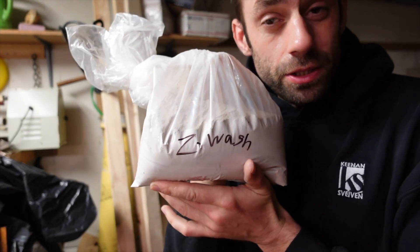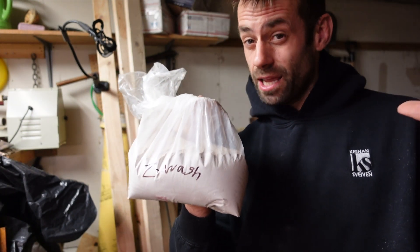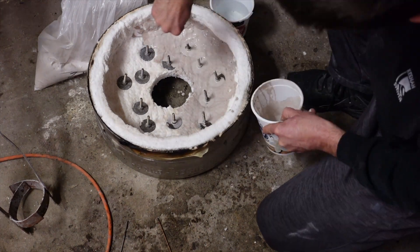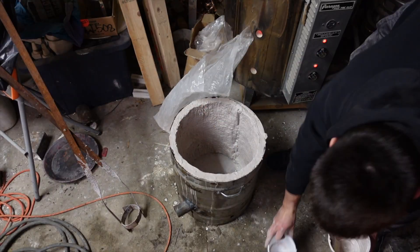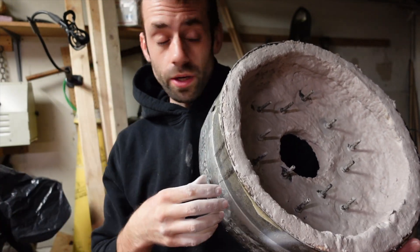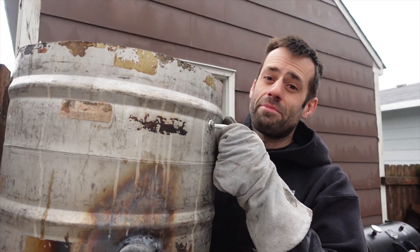This is another thing I got from the Firebrick store — it's Mineral Z-Wash. It's a powder: mix it with water, paint it on, it gets hard and can take the temperature. A real thin coat painted on there dries into a crust, and that's the only modification I'm going to make. We have a successful burnout kiln. Overall I'm super happy with it. If you want to see how that project turned out, come on back for the next video. Thanks for watching!